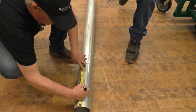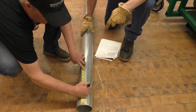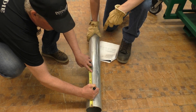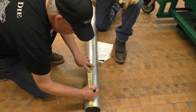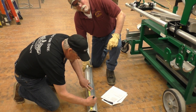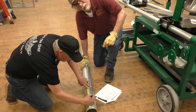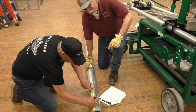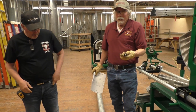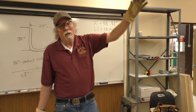The bending mark is at 5¾ inches. It's easier to put these marks all the way around the pipe so that no matter how you put it in, you'll see where your line needs to go. We're using dry erase markers here. If it's an exposed conduit run, you probably want to use a graphite or carpenter's pencil so you can erase it and it doesn't show up. If you use a Sharpie, it's permanent. Dry erase works nicely; Sharpie is fine if the conduit is up in the ceiling or out of sight.